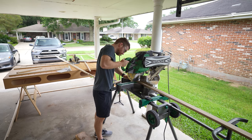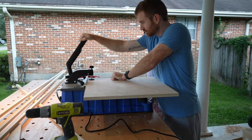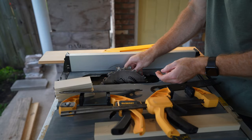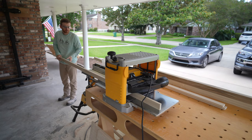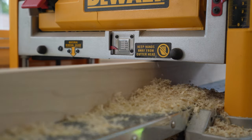What are you actually going to need for this build? I needed a table saw and a miter saw - you could probably get away without the miter saw if you have a table saw. A Kreg jig or a way to make pocket holes - I upgraded to the Foreman, which is awesome. A dado stack for the table saw, and I used a planer. The planer isn't 100% necessary but it helps tremendously because buying poplar boards and ripping them down, the thicknesses can vary quite a bit board to board. I run them through the planer to make sure everything is exactly the same thickness.